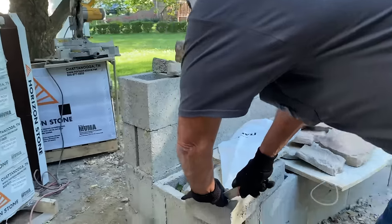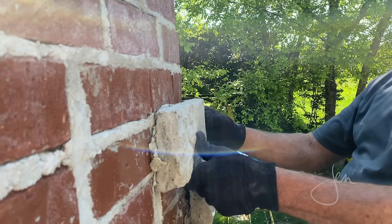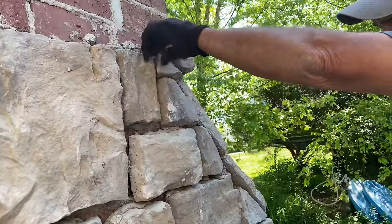We placed the stone so that it had thick joints for an overgrouted look. And together with a little whitewashing haze on some of the stone faces, it just adds to that casually imperfect yet elegant look. Once the stone was on, it was time to grout the joints.